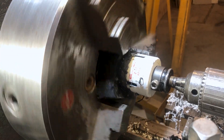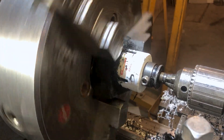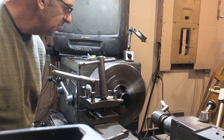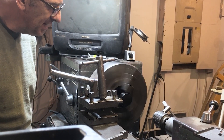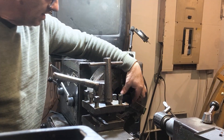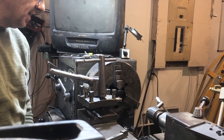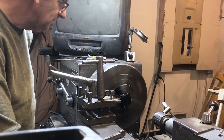I'm just drilling out the chunks from the square pieces. I actually decided not to put it in the oven because it's thick enough as is. Yes I know it's a three-jaw chuck and it should be a four-jaw chuck, but the thing weighs about 80 pounds and my back is sore. So I got the piece cut out and I'm turning it into a smooth cylinder. I don't want to take too much off because the thickness is what I need. I've got it 50 thou away from being perfect — two inches plus a tenth — which fits my vinyl tubing. Whatever vinyl tubing you buy, you'd size it to that.